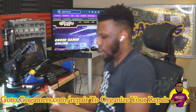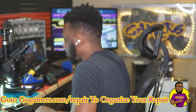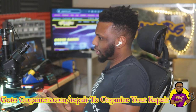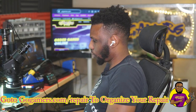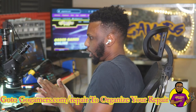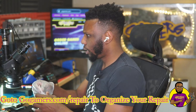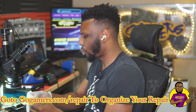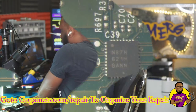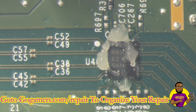We're going to replace that and see if it's truly our culprit. I'll show you exactly how to do it. Everything I use in my videos is in the description — the tweezers, the heat gun, everything. We're going to use my Hakko heat wand with a nozzle on it, and I'm going to apply some 8341 no-clean flux on that retimer chip. All right, we got that applied around there.